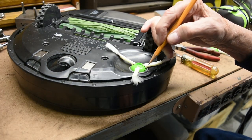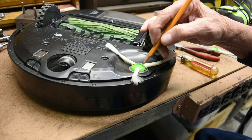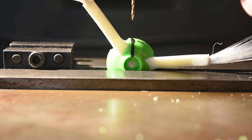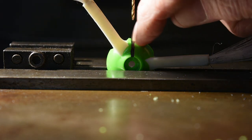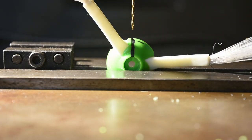I extended the line I drew on the other side of the hub so I could see where it would be on the front surface. What I planned to do next was to take this 50-thousandths drill bit and run it through the base of the hub and have it go through that center hole. It's pretty easy to line up on the milling machine or on a drill press, and you'll see how I'm going to pre-place this.